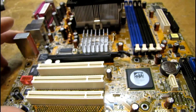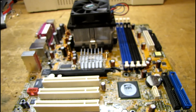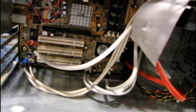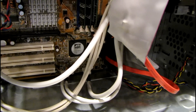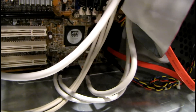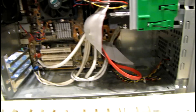Let me drop this back in the case and see if it'll actually boot into the OS. I've never started this computer up before, so this ought to be interesting. The only problem I ran into was right as I was finishing up the cables, the SATA connector for the hard drive was actually pulled right off the motherboard — just the pins sticking out — and the other end of the connector was still on the SATA cable. I got it back on there, but I don't know if it's going to have a good connection anymore. Those pins are extremely fragile. Nonetheless, I'm ready for the first power-up ever.